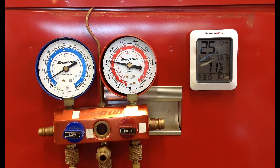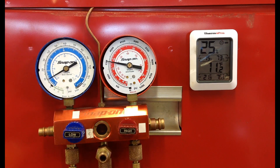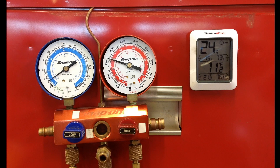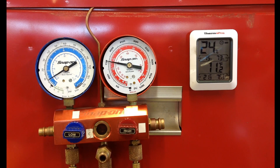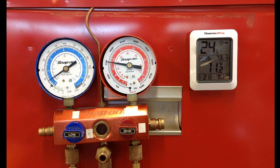Ambient temperature is 71 degrees in the shop with 25% humidity — a climate-controlled shop. Probably the first thing you're noticing is that the low side gauge is reading pretty low — under 10 psi, now down to about 6 psi. Right now the vehicle is blowing 20-degree air. A lot of times students will not notice a problem; they'll say it's blowing cold air, the low side is a little low, the high side is fairly normal, and it's a TXV system. On some systems going down to 10 psi could be considered normal, but in my view anything that low is a concern warranting further diagnostics.